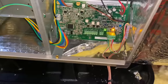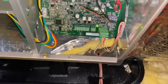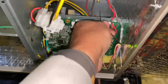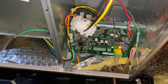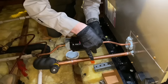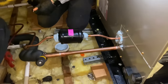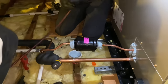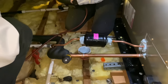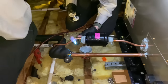In the meantime, our system is wired, power is applied. I'm using the brown and the black for the future hydronic relay that we're going to use. It's going to turn on the boiler for emergency heat purposes when it's too cold out. So the oil boiler is going to be a backup temporarily. And again, it's only temporary. And that's stage one of electrifying this house. We're getting rid of the oil boiler on phase two. But first, you've got to put solar panels on the roof.